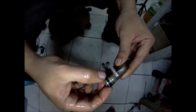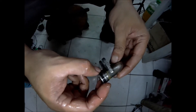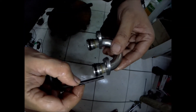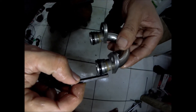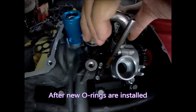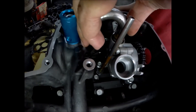As you can see, the new O-ring has better rubber protrusion against the steel groove of this U-pipe. You can see that this Allen wrench hits the O-ring first and it's not hitting the U-pipe. You will also see here that this U-pipe is harder to push into its socket.